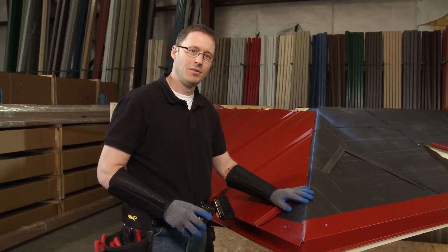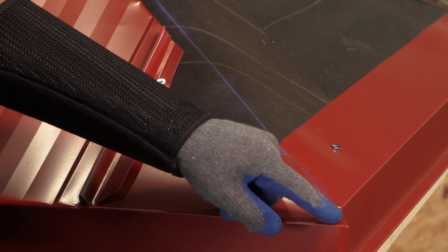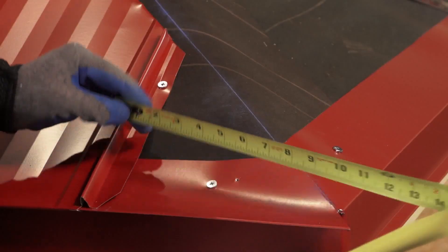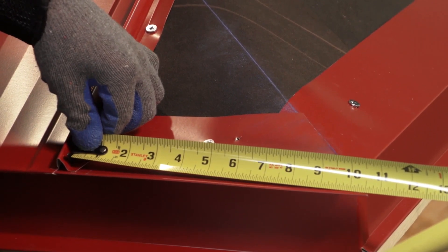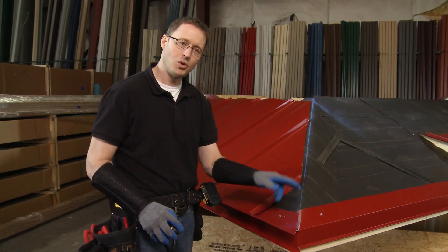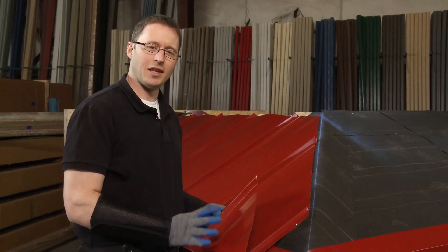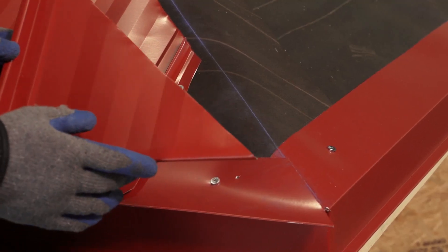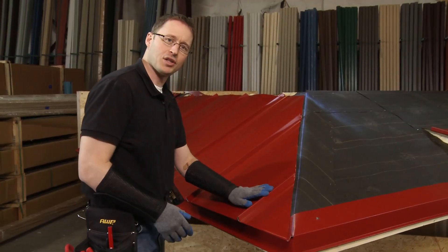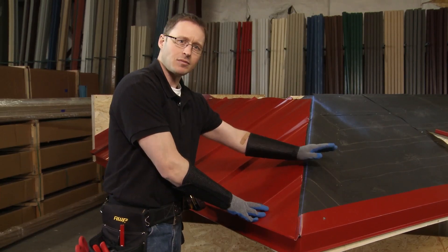We're on our last panel on the hip and this is going to be a very small panel. We have to calculate our long and take the width to our zero point. Measuring from the top to the bottom, it's 12 inches. Measuring over from the inside, it's about 10 and 3 quarters. So going from that measurement out 10 and 3 quarters and joining those two lines will give us our final panel for this hip. We've taken the measurements, prepared the final hip panel — it's a small piece — and we install it here on the hip. That finishes the hip panels on this side. We still have the other side of the hip to do before we can install the hip cap.